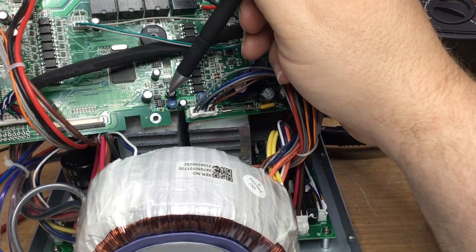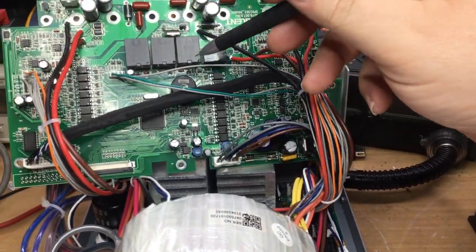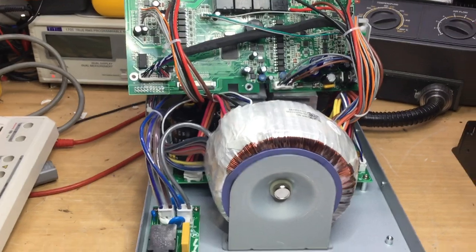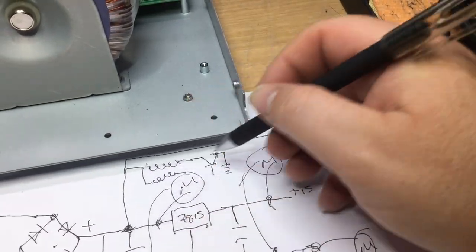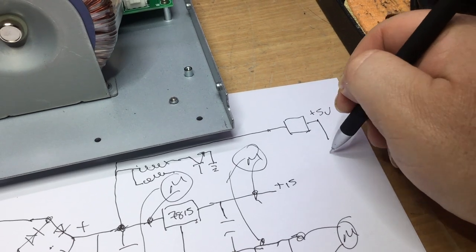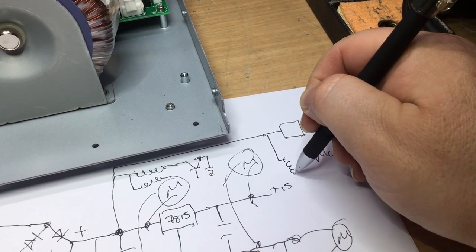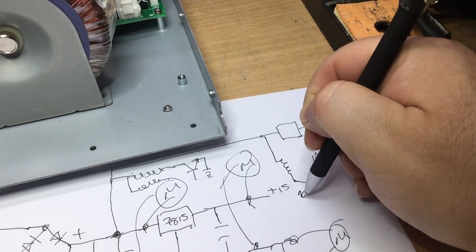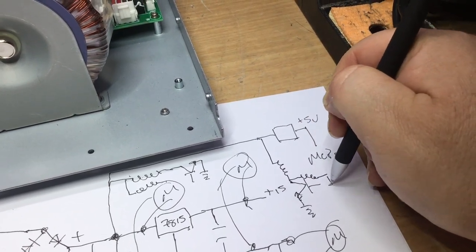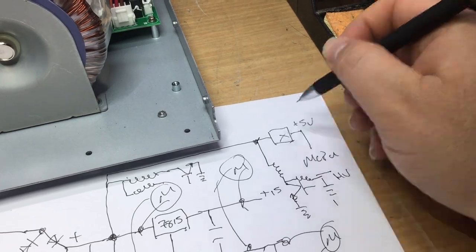And I can definitely hear the frequency of this changing as this bridge rectifier down there is getting loaded with the relays, when these relays are switched on. So it's reducing the voltage, probably because this can't keep up with it for some reason, I don't know. But yeah, so we have this extra line that comes off there from the unregulated. That appears to then go to another voltage regulator, which could be a plus 5 volt for the MCU. And then prior to that, I think we'd probably have some buck coils and switching arrangement going on there. I think from the look of it, there's definitely some naughtiness going on there. And then probably some more coils here, and then reservoir caps, etc., for the high voltage for the display, something of that order. But I'm not sure yet what this one is.